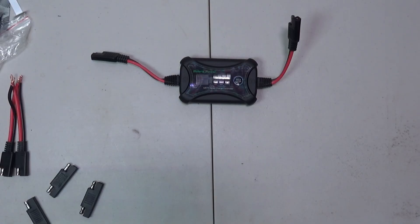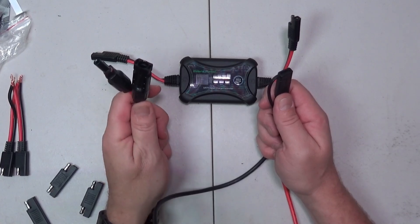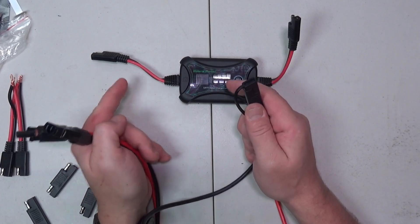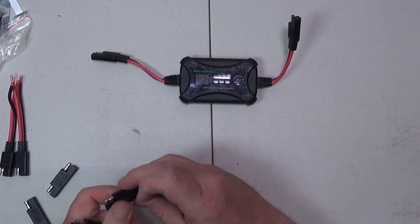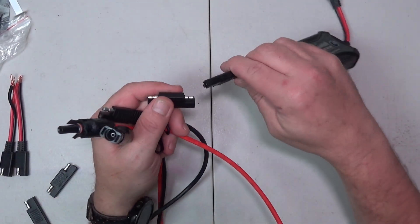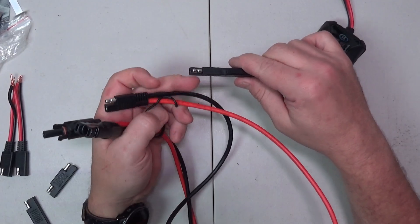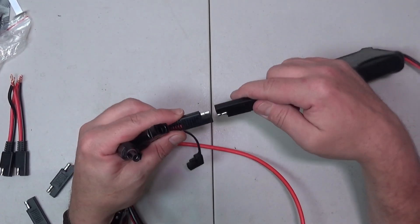Because I don't want to cut any wires on that solar panel I had to order some adapters. First thing I ordered is this connector here which goes MC4 from the solar panels to the SAE adapter. And it's going to be pretty easy to do — we just need to keep our reds and our blacks in line, and to do that we are going to use one of these little connectors.